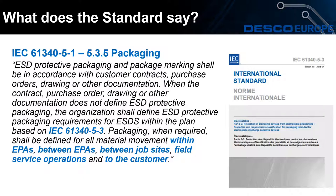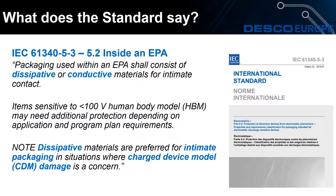This is what the standard says. A plan should be documented for different ESD protected areas and moving products. If you don't have a plan, you are setting yourself up for each operator to decide what they can use, resulting in different packaging being used and in some cases no packaging at all. Imagine you're inside an ESD protected area with no ESD safe floor, and employees are transporting ESD sensitive devices from shelving to a work surface. Without a plan, the operator could take the device out of the bag and place it on top, thinking it's protected, while walking to the ESD workbench — meaning that ESD sensitive device will be charging up because they're not grounded and there's no shielding barrier.